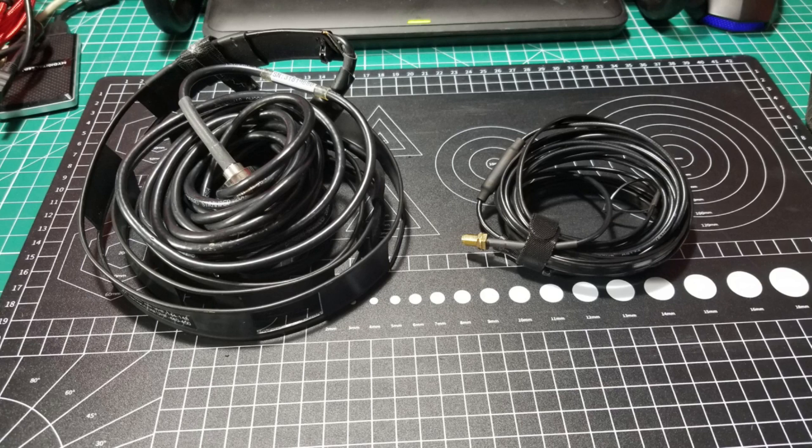I'm planning to put two of the really small lightweight Slim Jims into this box — one for 2 meters and 70 centimeters (146 and 440 MHz), and one I'll build myself for 1.25 meters, the 220 MHz band. I want to try my hand at making one, and that'll become another Elcara from the Bench episode. Now we'll move on to the mid-tier of the box.